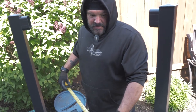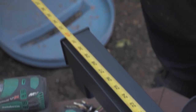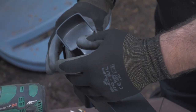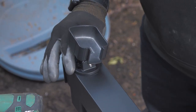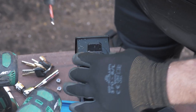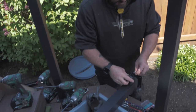You want to put your next bracket 29 and a half inches in between the brackets like that, and that'll put you in line with the top rail going around here. I've got my side-to-side, but I'm going to need some up-and-down brackets — one set, two sets, three sets.